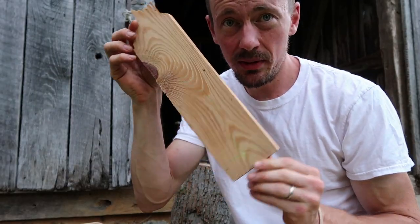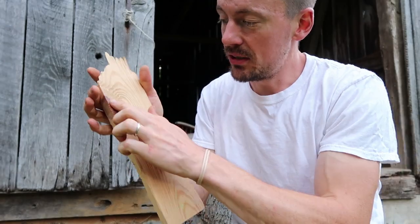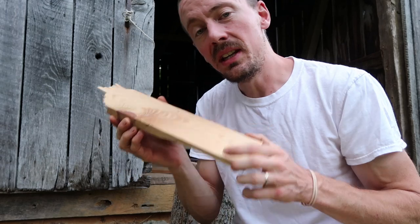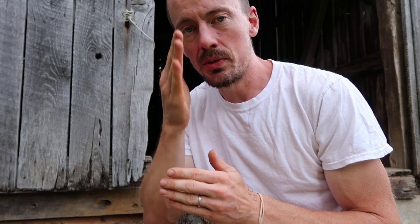When you look at a piece of sawn lumber, you see the grain will run all different directions. The saw blade will cut through knots, through crooked grain, so sawn lumber can actually be weaker and more prone to twisting and bending as it dries or with moisture changes. When you rive lumber or split it with a fro, you end up with perfectly straight grain running end to end through your board. This makes for extremely stable wood, allowing early settlers in rural areas with no sawmills to make green wood furniture — chairs, paneling — that remained very stable because the grain was perfectly straight.